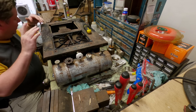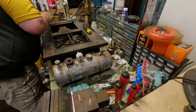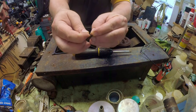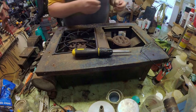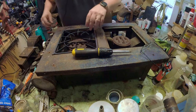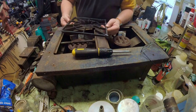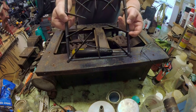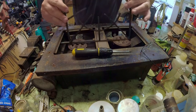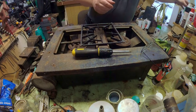It was actually really pretty simple. The top is held on with some little spring clips and then just a simple screw, so even though this thing is as old as dirt and very rusty, everything came apart super easy. You might see that this grate here is really quite black — it has gone through treatment in my electrolytic cell to de-rust it. I did all the electrolytic rust removal on that and it looks pretty good.